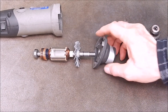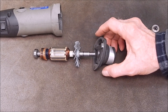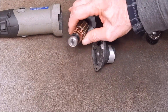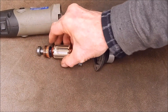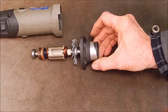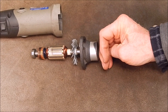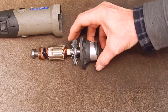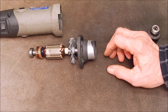To put it back together with the armature out, the way I would do it — if you haven't got a press — is just do it in the lathe. Put a dead centre in the chuck, put the point of the dead centre on that end of the shaft, put this on here, and then use the tailstock ram with a piece of wood over it to press the bearing onto the shaft. That would be plenty adequate pressure to do that, no problem.